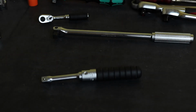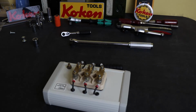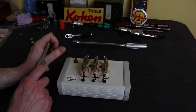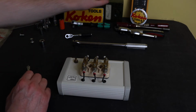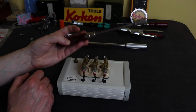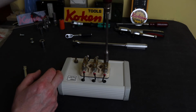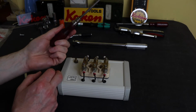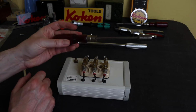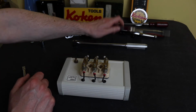So if I bring my little simulator back up and in, and probably zoom out again so we can see a little bit of what we're doing. Typical arrangement for a motor terminal box here. Traditionally I would use something like these nut drivers, nut spinners, on top, and you can undo it and spin it back up again. Now sometimes I struggle with how tight these are, and I can't actually undo them with a nut spinner, and I have to use a socket or a spanner or something like that.